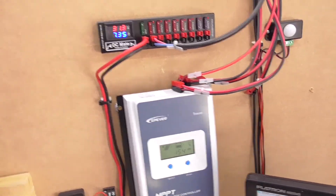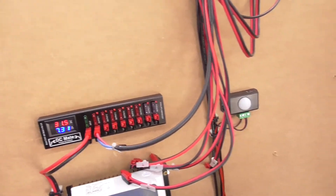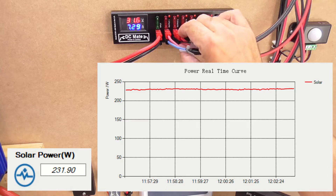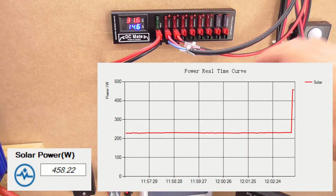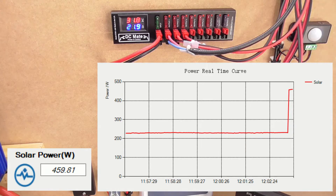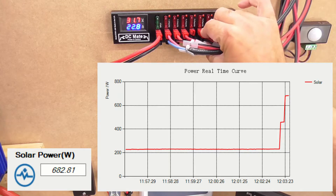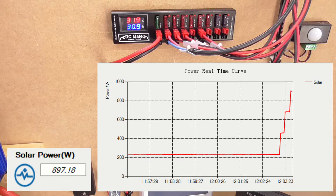Just one panel connected at the moment. If I plug some others in — so that's one panel connected, and we can see the output power on screen. We're doing 230 watts at the moment. Plugging in panel number two, we should see this jump up — and that goes up to 458 watts. Panel number three goes in, and that goes up to 679, 680 watts. Panels four and six I won't connect straight away because they've got a little bit of shade on them. Panel number five has no shade on it, so that goes in — and we're up to just 900 watts.